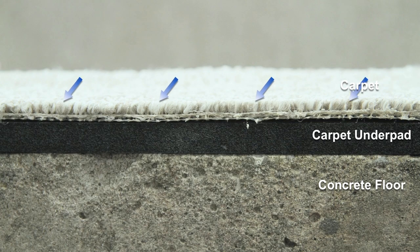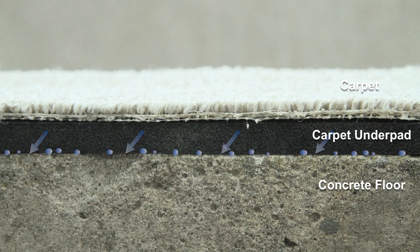Carpet on a concrete floor is definitely not much better either. Besides being hard and cold on your feet during winter, carpet and underlay applied directly to a concrete floor can encourage condensation during humid summer weather. For 25 years, I've helped homeowners deal with cold, musty finished basement spaces, and there's no question in my mind that we need to finish basements differently than we do now.